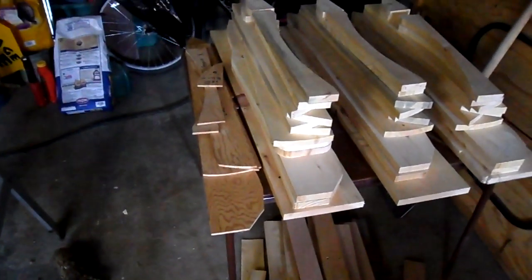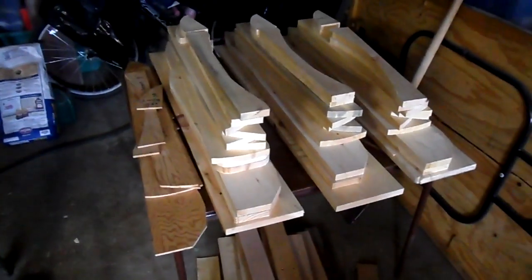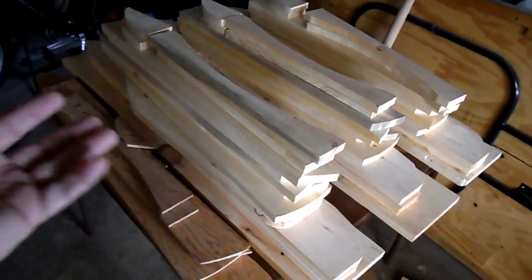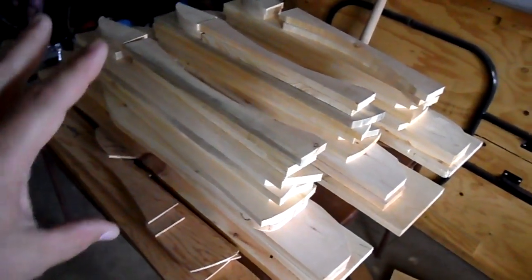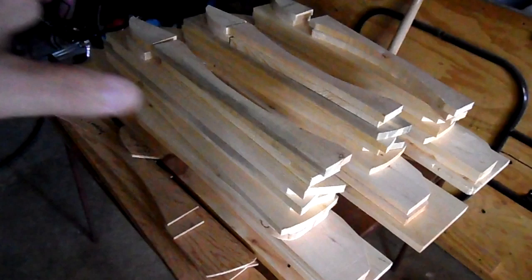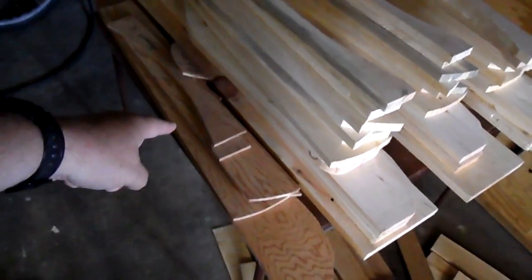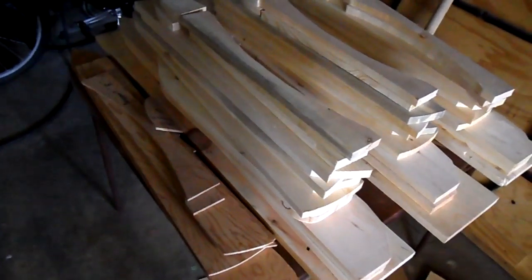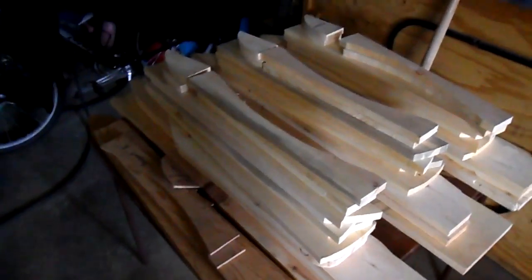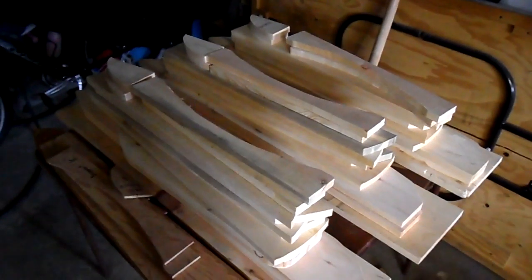On the far left here are all my templates that I'll be able to use in the future. My theory is some of these components have holes drilled into them with carriage bolts holding them together. So I'm going to put one chair together, clamp it, and drill the holes where I need to, then disassemble it and put my corresponding template on that piece, and drill through my template. That way I will have all the holes that I need in the template. So at the time I'm doing the flush trim router bit trimming on each piece, I can go ahead and drill the holes.